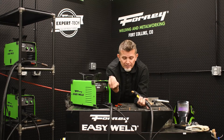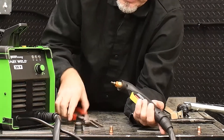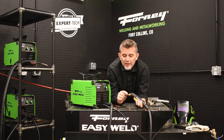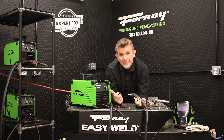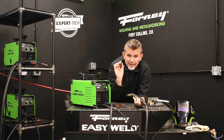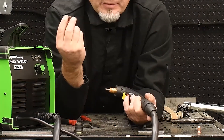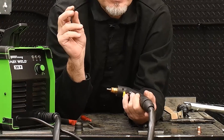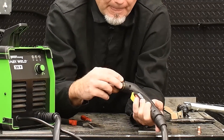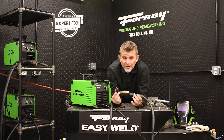So let's go ahead and put everything back together again. I put my electrode in and thread it in. I'm going to tighten it — just give it a little bit of a turn, not too much. You don't want to really crank it because then you'll break off your electrode inside your torch head. So I have my electrode in there nice and tight. Don't forget your swirl ring — I have a lot of customers that forget the swirl ring. This torch will not work without the swirl ring. I'll take my tip — I'm going to use the used tip because it's in pretty good shape, I'll probably get another hour of cutting out of it. Put that in, then I'll take my cup, put that on, and I'm just going to hand tighten this cup. And that's how you take care of your torch. If you ever have any problems with this torch, just give us a call.